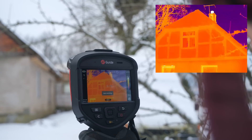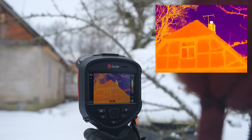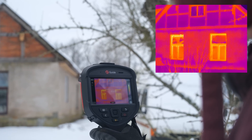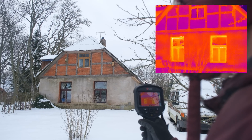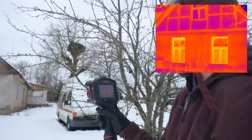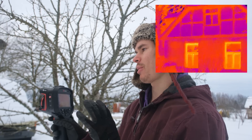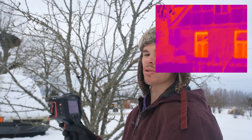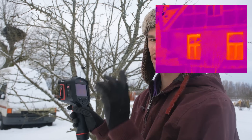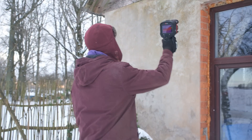That's a fun picture of our house — a lot different than usual. You can see the chimney top is the warmest part at 21 degrees — that's where the flue comes out. Checking the bottom, there's an obvious heat leak at the top of the window too. I think that is the foam that the birds have been stealing — the foam is missing. We haven't done cement on a few windows yet because we've been too busy, and the birds have stolen almost all the foam. Let's go check closer — oh my god, it's completely out of the room.